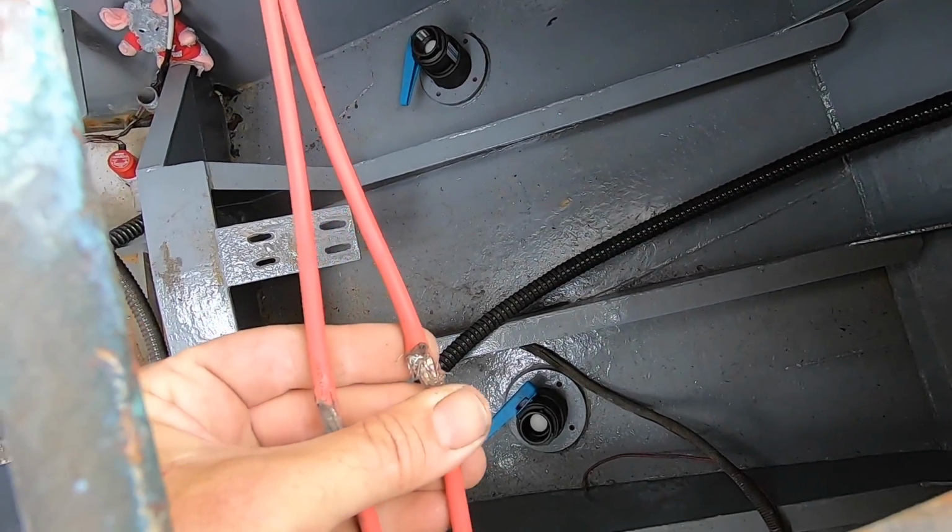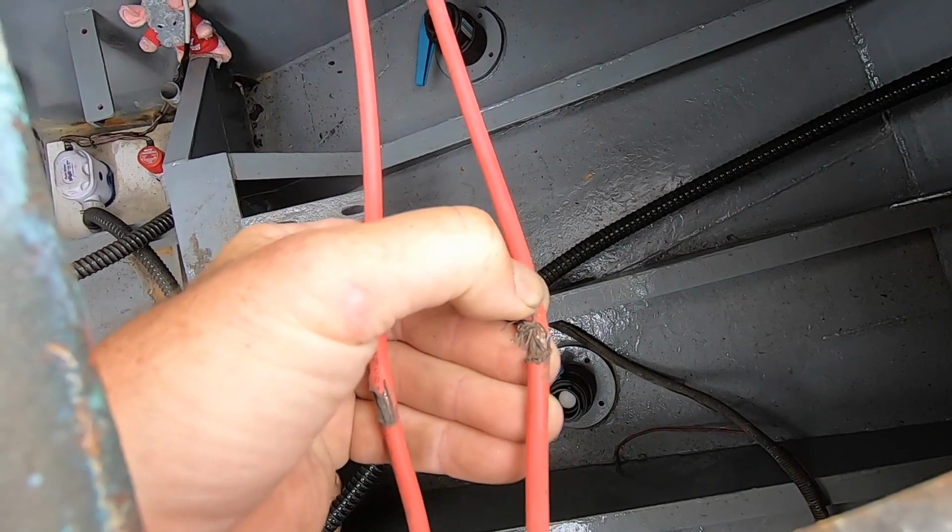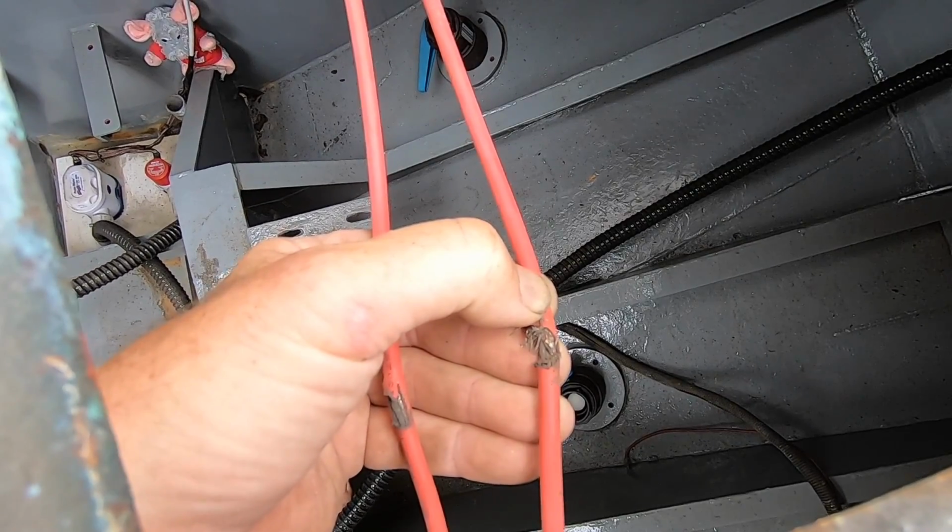I was doing shallow cuts along here, and when I swapped the Sawzall, I nicked my 2 positive feeds, unfortunately. Everything still works, but you know, come this far to leave that ratty. To make a bit of a positive out of an annoying situation, I'm actually going to take that wire, use it in lots of places, and replace them with new continuous runs of a heavier gauge. I think that was possibly a bit too light to begin with anyway, so that's the motivation I need to upgrade it. Obviously there's plenty of usable wire there still, so I'll keep it and use it for other things, but I'm going to grab 2 new full lengths and just replace them. But not till the deck's finished, so it doesn't happen again.